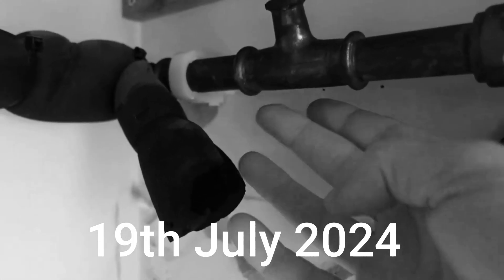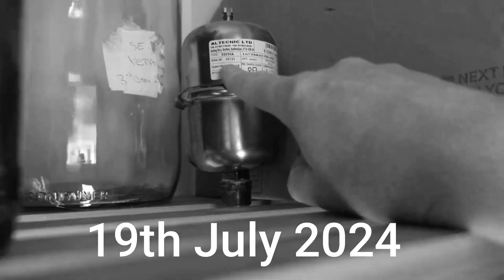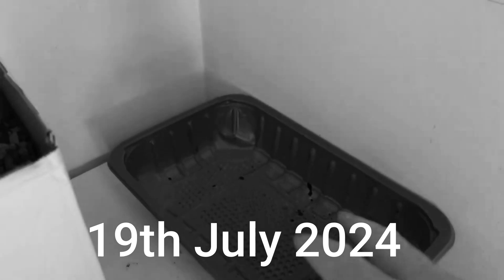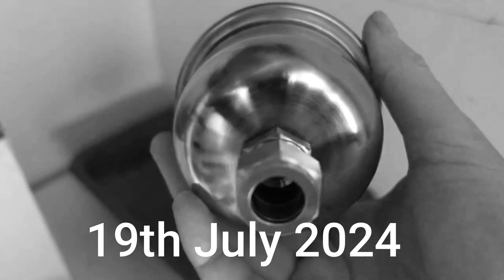Last week I did see a small amount of leakage from this area, coming from this expansion vessel, which has got a bit of corrosion. I left a tray underneath to catch the tiny drips that were dripping and going down the side, then appearing as a damp patch on the floor. So I bought a new expansion vessel, exactly the same make and model, ready to bolt on.